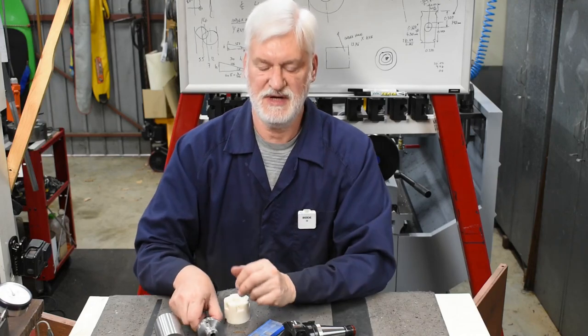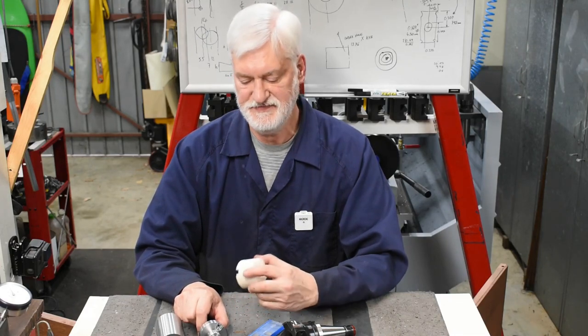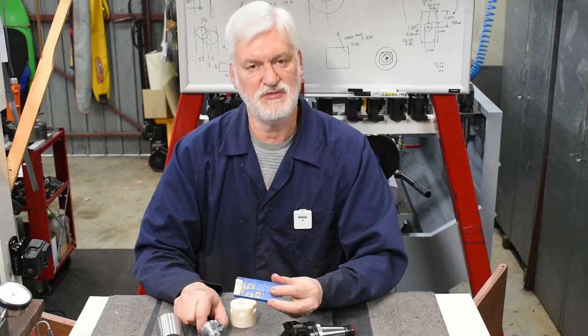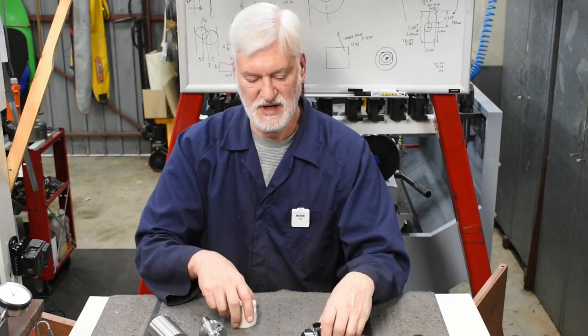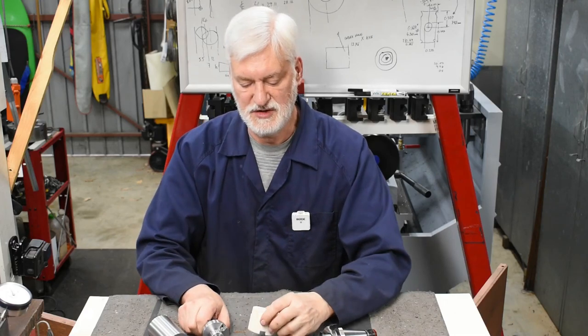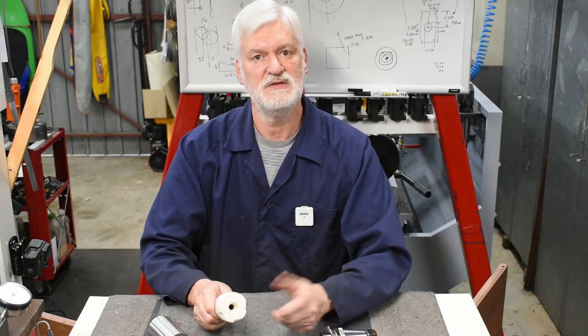In my previous video, I made an arbor and I had a bit of a tease with this, and perhaps you worked out that this is intended to be a milling cutter. What started me off was I had a pack of carbide inserts that looked really good and should be used for something. And I had some scrap steel and I thought, I'm going to make one of these for those. Along the way, I decided to reuse that arbor, as you saw, so that I could cut these pockets in the rotary table, I had to make up this arbor as a staging thing. Anyway, please stay with me as I make the face mill this time, and join me also at the end to see how well it works.